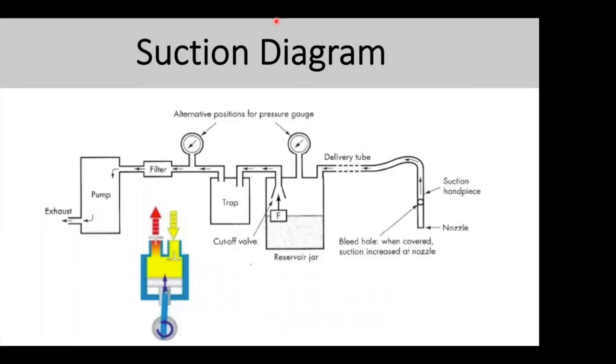A couple of questions about low pressure: what can cause low pressure output in a suction machine? Low pressure can be caused by the diaphragm or the check valve not working properly anymore. Each piston pump on the suction machine may have two or single pistons. If it's a single one and the check valve is broken or not working, that will give you very low pressure. From the jar section, it can be a missing O-ring or the jar itself having a crack or leak, which causes leakage as well.